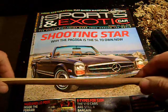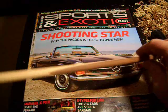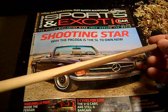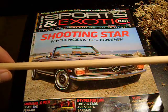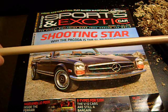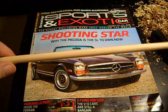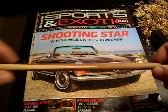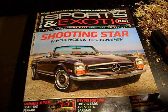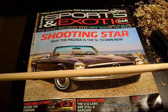After a little time sanding in the garage, hopefully you can tell that's pretty damn round. This is what the footed part looks like — that's all pretty good. The downside is right now this arrow spines at about 75 pounds, which is a little more than what I need. So for my next trick, I'm going to make this a barreled shaft — meaning I'm going to taper this end: narrower down to the point, same thing on the back end. I'm going to use the block plane to do that.